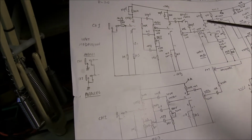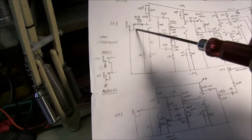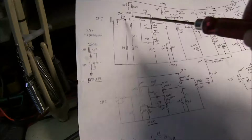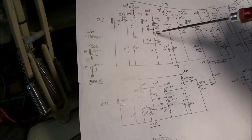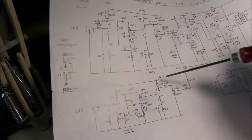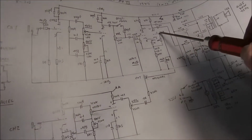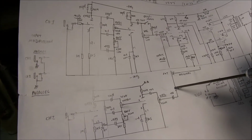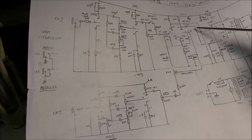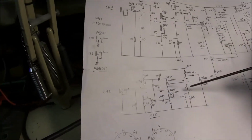Now I do an input mod where you can have one channel if you plug in there, and if you plug in the other channel, your guitar goes through both, and then you can adjust the tone controls on both of them and add them together. But you do have to move this channel from one side of the phase splitter just through a 470k to this point so they join together, otherwise they cancel out because they're in opposite phases. That's a good mod to do.